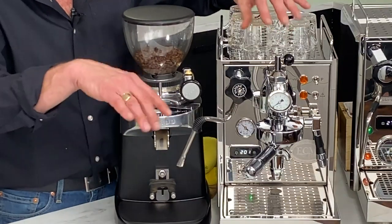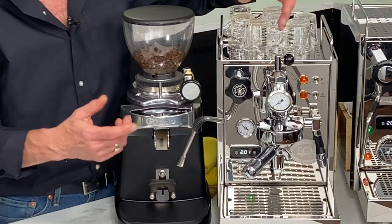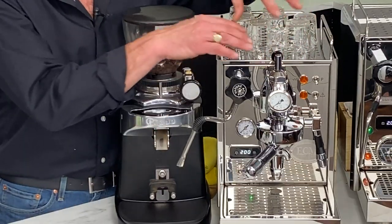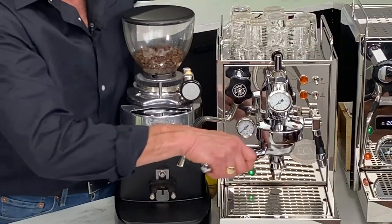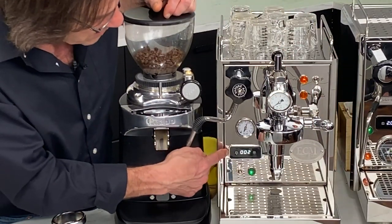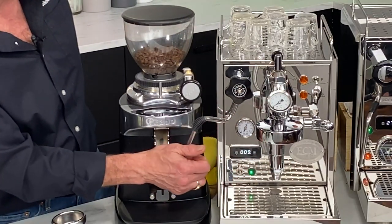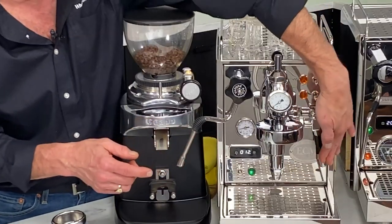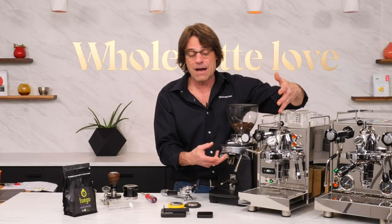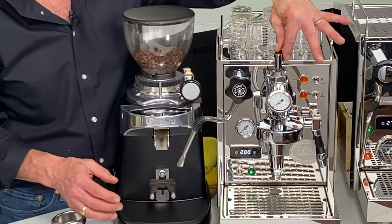When you're using a flow control machine you want to know your flow rate at certain valve positions - I call it calibration. It sounds more complex than it is. There's a link in the description showing how to do it. What you do is open your valve at a quarter turn, then for 20 seconds let water run into a container, weigh the amount or measure the volume, then divide by 20 - that gives you the flow rate at that position. You continue doing this at half a turn, three quarters, one turn, and so on up to two turns.